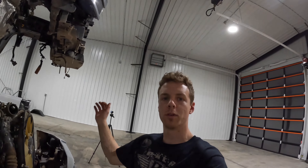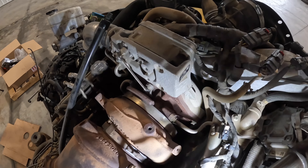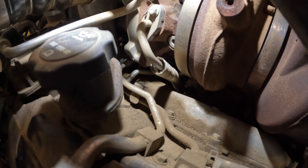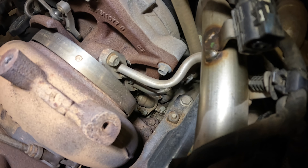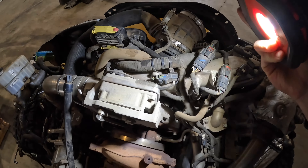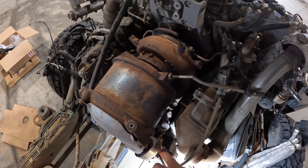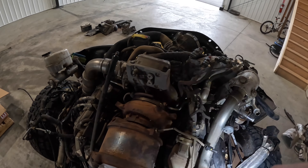So it's the next day and I just went ahead and pulled this heat shield off first. These ones must be a little bit different than the older ones - looks like there's just four bolts right there. I have to unhook a couple lines here, and on this side just the one line. There are two more at the bottom. I'm going to take this front plastic intake off the front - just one plug and the booster line should pop right out. I might actually just take this converter right off to make my life really easy. Put a little penetrating fluid on there and pop that out of the way and it'll be really easy to change that.